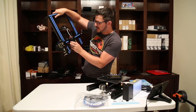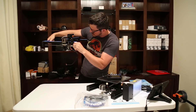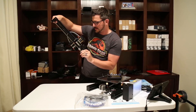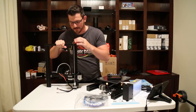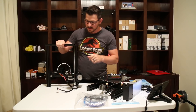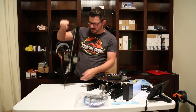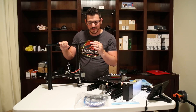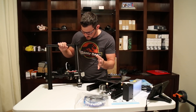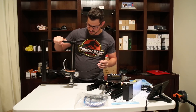The cooling fan is on the side. It does have a part cooling fan with a duct that goes right onto the hot end — it's like an E3D knockoff with a captive nut in there for some play. They're using a Molex-style connector, kind of like when you have a modular power supply and how it interfaces. It's one cable for the extruder and the hot end and all that, which is nice.